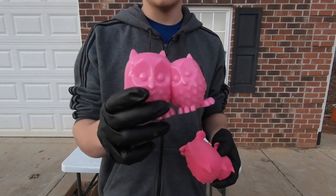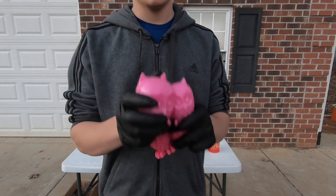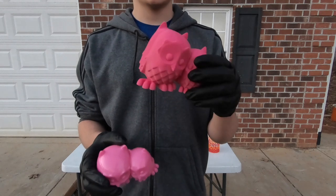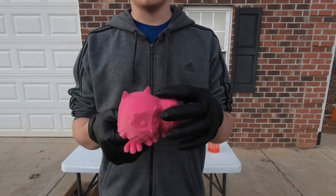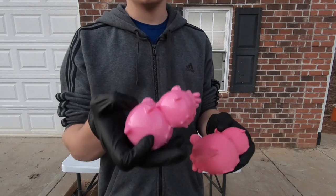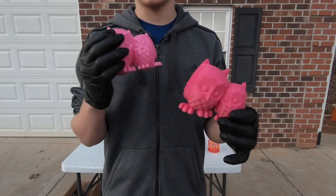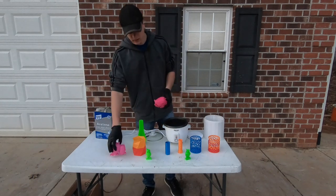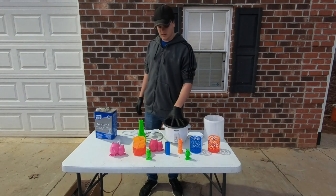To make it all glossy. So this is an acetone smoothed part — you can see how glossy it is and how there's like no layer lines or anything like that. And this is a very extremely strong part. And then here we go with the non-acetone smoothed — still very strong, but it's more of a flat appearance and there's some blemishes, you can see some top layers there, where on this model it's completely disappeared. So that is the main benefit of acetone smoothing: it looks a lot better. It also just gives your parts an all-around more professional, injection-molded type appearance.